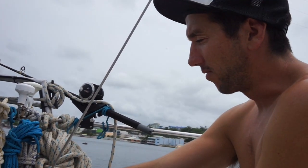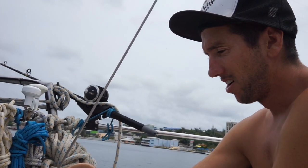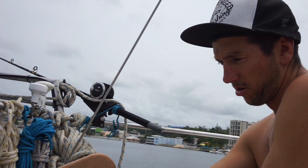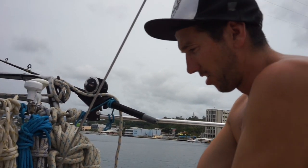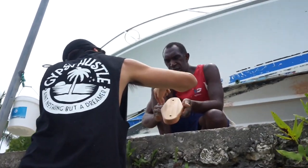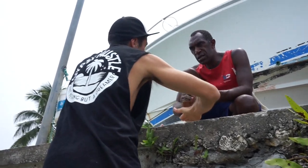But we want to make it so that the strut that pokes out is at like a 15 degree angle. So we need to basically make this a 30 degree angle. If that makes sense. But I need to somehow chamfer that, which I really don't know how it's going to happen in Vanuatu. This edge stays the same, but it needs to be perfectly straight.